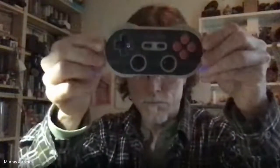So anyway, that's been my project. Basically, I've got it running now. There's a toggle switch on the robot that switches on and off a daemon that's running in the background. So I've got basically a Linux daemon running, and when I flip the toggle switch, it turns on the robot operating system. In this case, it's the Gamepad Demo. And then I can take the gamepad controller and use it. At this point, like I said, it's just telerobotics.